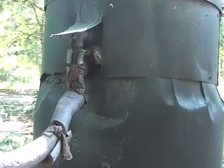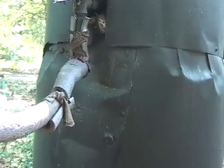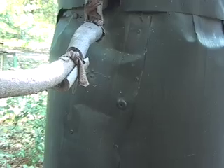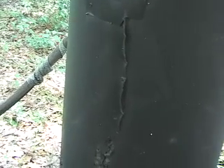This is the hot water outlet that's coming out. We've added this jacket from a gas-fired water heater to give us more insulation — we can put in an extra couple inches of insulation. We simply cut the jacket off and then reattached it with self-tapping metal screws. It's not the most elegant design, but it does work, and it means that we can go for at least two days and sometimes three days without having to build a fire, because the hot water heater is insulated enough to keep the water hot for that long.